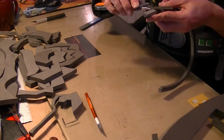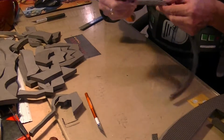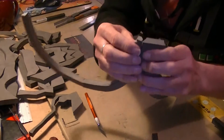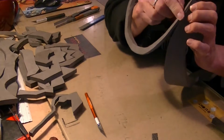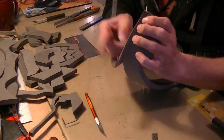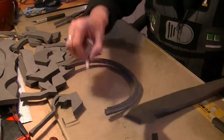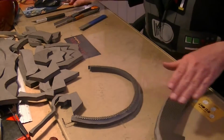Okay, that can go down there in the file, and you could do with a little bit of cleaning up, but now that I've got those two edges, once I glue them together and then roll them in, that's going to give me a rounded edge, more reminiscent of the curved, less precise smelting technique, blacksmithing technique, the helmet's based on.